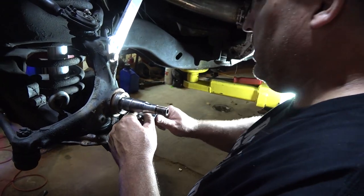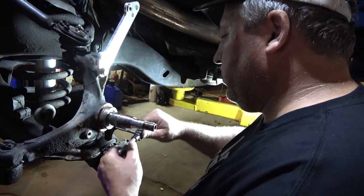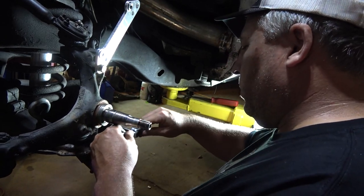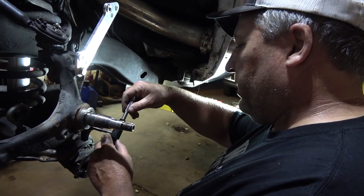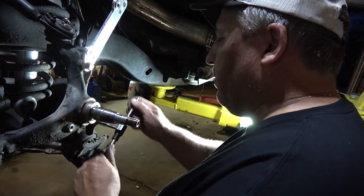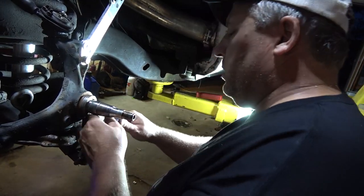So we've got our holes drilled. I've already tapped that one. I'm just going to run this tap in and thread this bolt hole. One thing you want to make sure you don't do when you're tapping threads in a brand new hole — you want to take it in so far and then back it out a little bit and clean the threads out. You don't want to just go one direction all the way in or you'll most likely end up tearing the threads up or breaking the tap off in the bolt hole. I usually go in two or three turns, then back it off a couple times, and once I'm in as far as I want, I'll take it out and clean the threads.